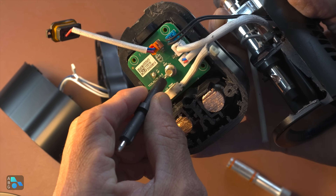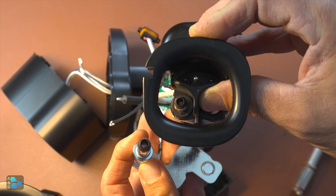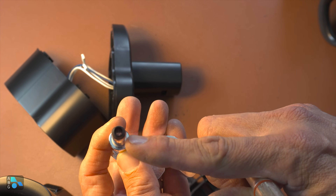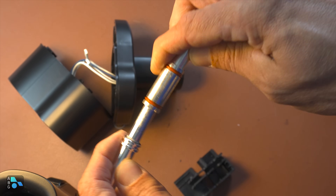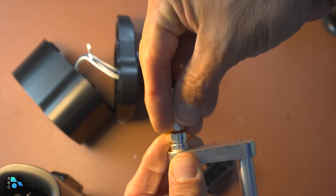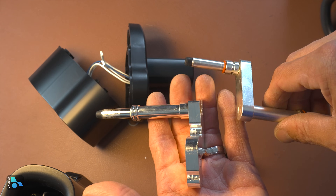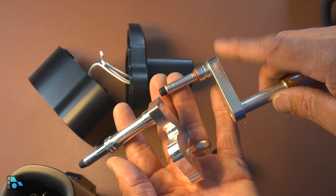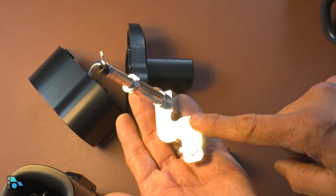Then we have this grounding pin that literally just connects the ground pin on one side through the adapter over to the ground pin on the other side. I've gone ahead and removed one of the NACS pins because there is an interesting touch with NACS. You'll notice the mating side — this is the side that's on the adapter — there's actually a pin in the middle, a post inside the middle, so it's not just contacting around the outside; there's also a pin that contacts on the inside. On the CCS side, the only contact place is on the outside of that connector right there. One of the other things I noticed with this teardown is the quality of the pins — the one in the Electron adapter is definitely heavier than the one in this cheap knockoff import adapter.